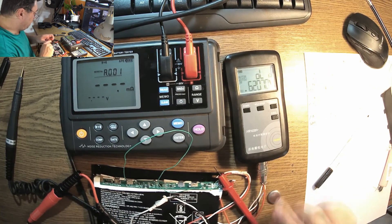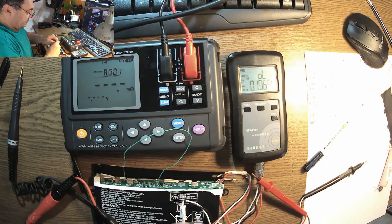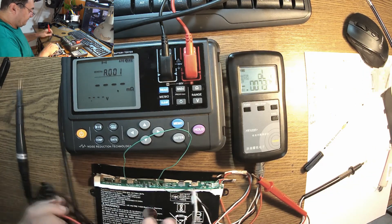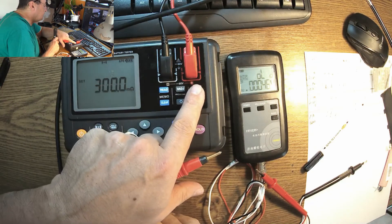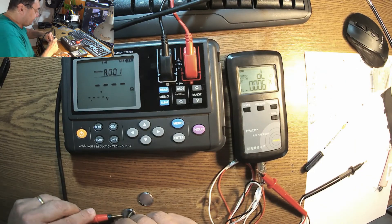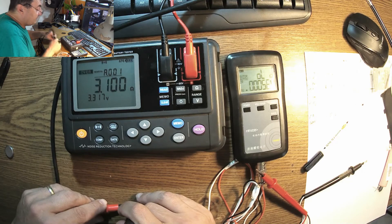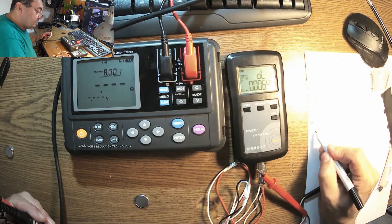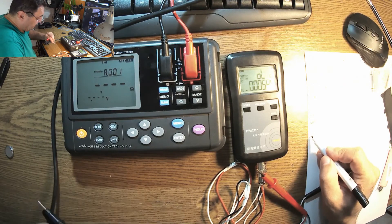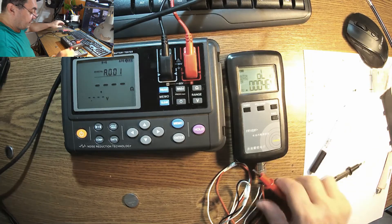What about this little lithium coin cell? Oh, it's gone. What about a new one? Let's try with the HiOki first. It seems like it's another range — 3.1 ohms. It's a CR2032. The HiOki reads 3.1 ohms on the new one and 3.0 ohms as well. The wasted one gives nothing.